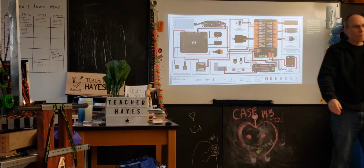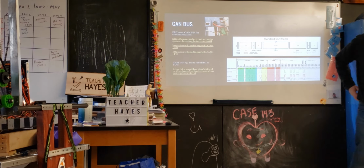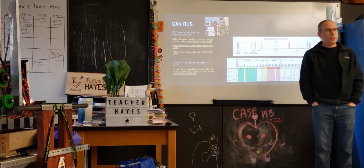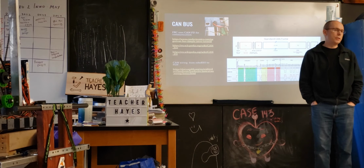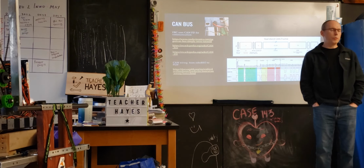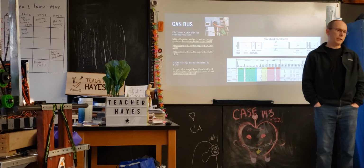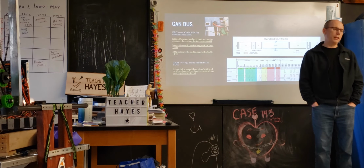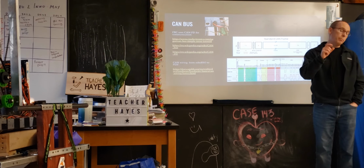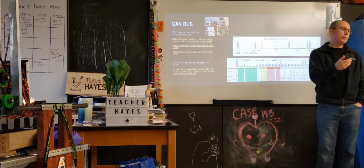Is daisy chaining bad? Because I remember from bigger cables that daisy chaining is bad. Is it different with the smaller cables on the robot? It depends. In this case, there are some specifications around how many devices can be on the CAN bus. Each one can be sending information, and each one has a certain amount of impedance. So there's a limit on how many devices you can have on your CAN bus. There are also specifications around the termination resistance, the impedance you have at the start and the end of the entire chain. So there are some constraints, but generally it's not a problem.